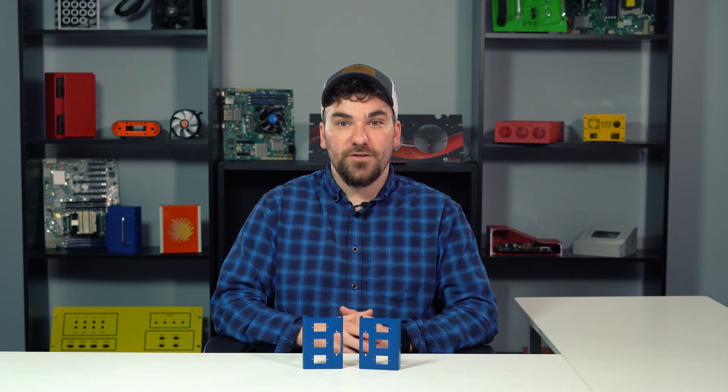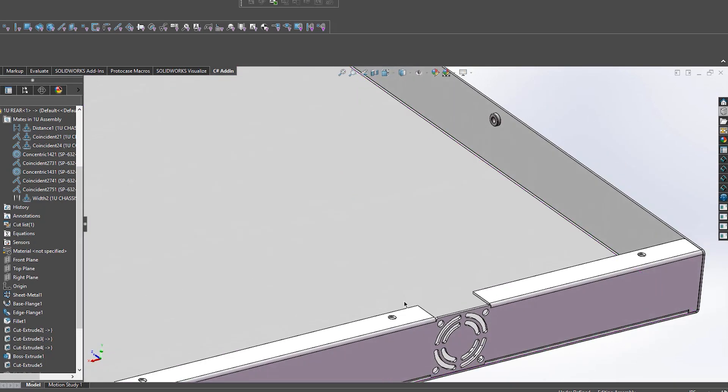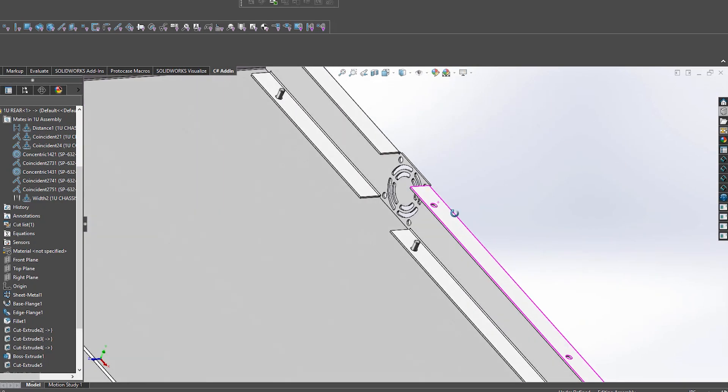Number two: bend sectioning. This can be especially useful in rack mount enclosures, particularly 1U rack mounts which are the smallest height-wise. Deploying a notch will allow the proper cutout to be accommodated, because the panel flanges have been sectioned rather than going straight across.